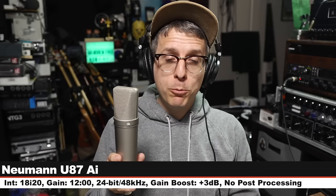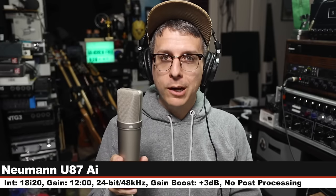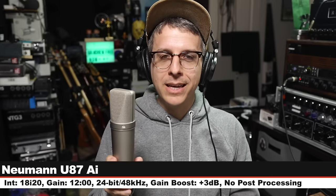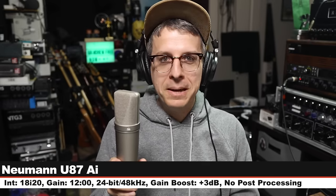Cardioid mode, no pad, no filter, 6 inches off, gain set at noon, 12 o'clock. And why am I assigning a day or night indicator to the... You get the point. Okay, let's go to the music test.